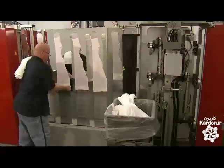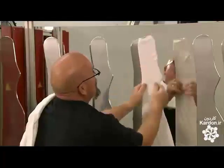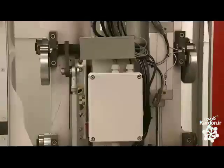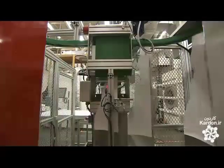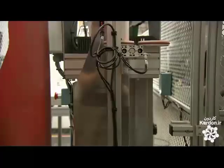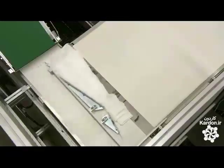Whether it's a multiple-component pantyhose or a simple thigh-high or knee-high stocking, the production steps from this point on are the same. Workers slide each stocking onto a heated aluminum leg form in the size they're producing. Laser lines show exactly where to align the heel and other parts on the form. Then, one by one, the forms enter a pressurized steam chamber for about four seconds — enough to permanently lock the form's shape into the nylon. The form then enters a dryer, stopping for about 15 seconds while hot forced air evaporates the steam-infused moisture. When the stocking comes off the form, it's dry and leg-shaped.